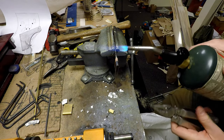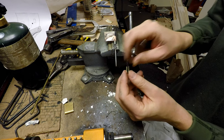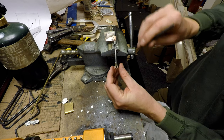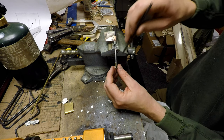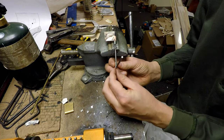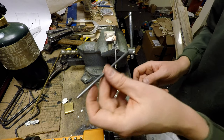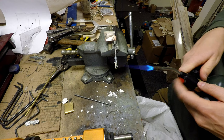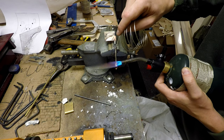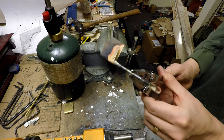Once it's cooled off, I take another small piece of brass for the other end of the rod — a U-shape that's been pinched slightly so it holds itself on the end. I orient it perpendicular to the flag-shaped piece, use a scrap rod to push it all the way on, and confirm it's perfectly perpendicular. Then I pull the rod out, apply a little more white brazing flux, and again focus the heat more on the steel than on the brass. That completes the brazing for the lower support arm.